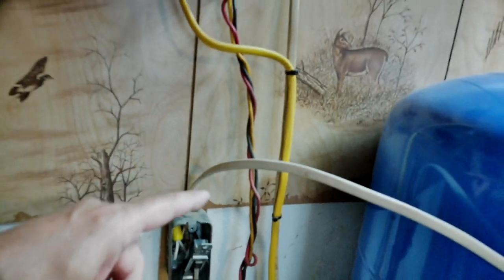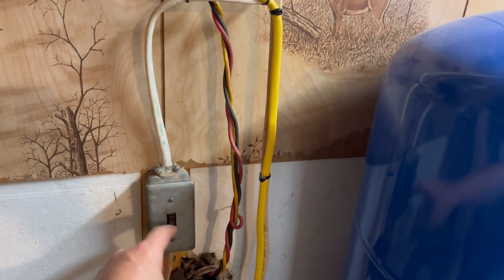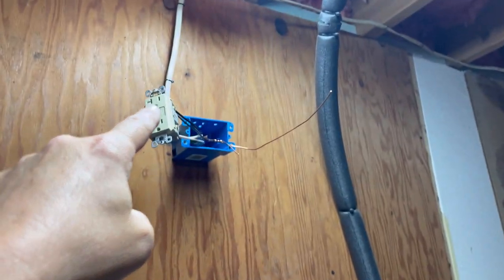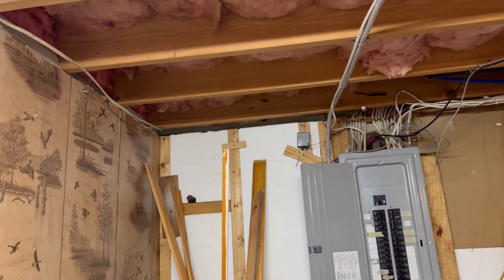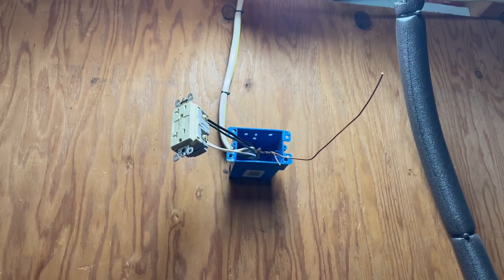I ended up not using a new piece of wire — I have another piece from a different project that's going to be long enough to reach. You can see it a little bit easier here. Right now there is no power coming to this so it's not going to work, but it comes up across to the ceiling and then over to here where I do have them hooked up to the load side, because the line side is going to go from here to the breaker box. That way everything connected to this afterwards will be protected by this.